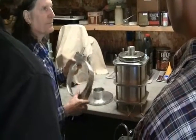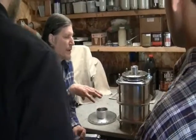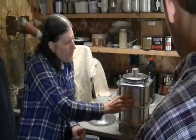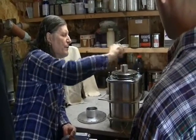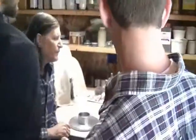The center part of the alternator I made myself. The outer part — the stator — is a car alternator stator, one of your 60-amp stators. The center is actually a bunch of circular samarium super magnets. You can feel the resistance — those magnets actually resist any kind of start-up movement.